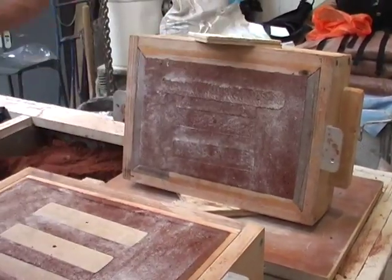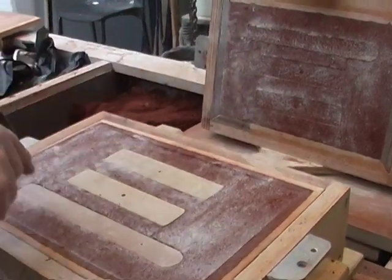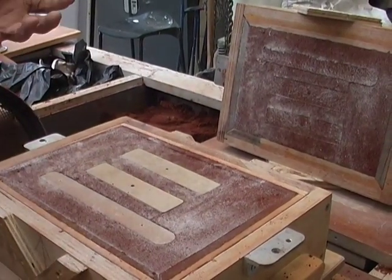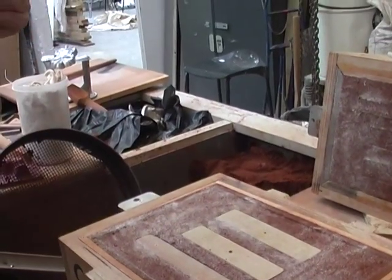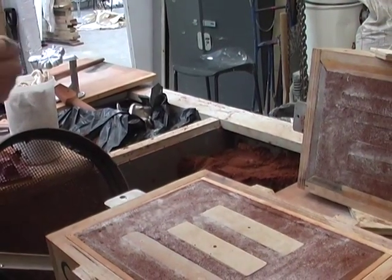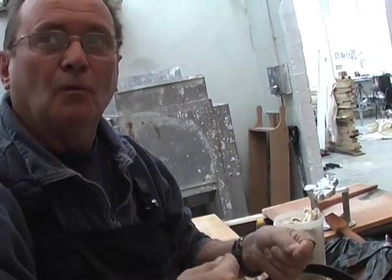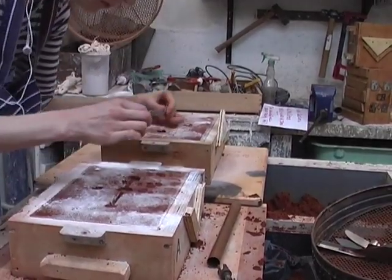It would be possible to fill the two boxes with sand as we have done, take them apart, draw in one and take a print of it with the other box — so you'd have the print of the bottom box on the top box — and then work by cutting and carving into the sand. The sand will enable you to do that. So although we are talking about patterns that were previously made, it is possible to use exactly the same process but to create the void in a much more freehand way.